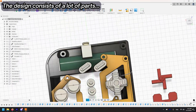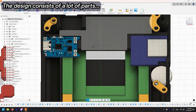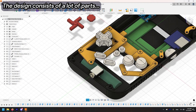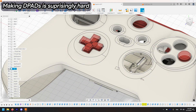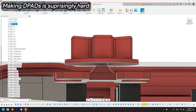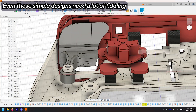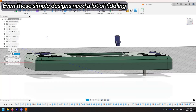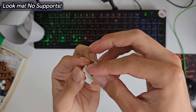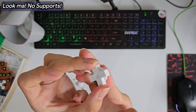Designing the controls was also a big chore. Trying to make the D-pad actually feel right was surprisingly challenging. On all my other designs in past years, I always put the pivot of the D-pad near the physical buttons rather than on the D-pad cross itself, to avoid extra complexity. However, with these soft-touch buttons, that technique just didn't work out. In the end, I managed to make a simple two-piece D-pad design that was just good enough for the job.